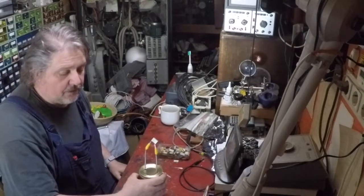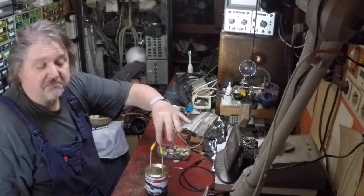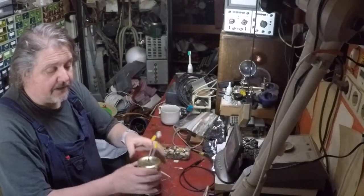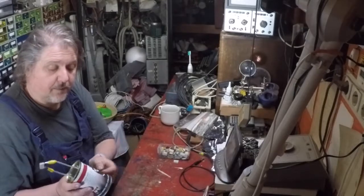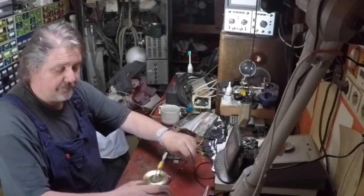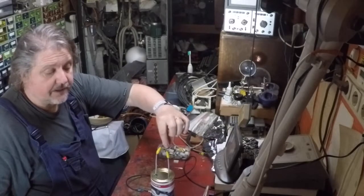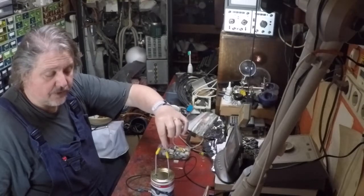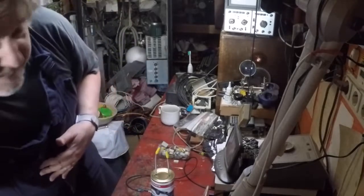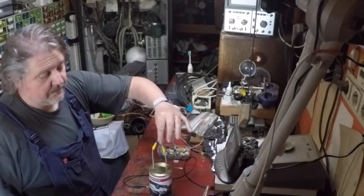What you see now hopefully is that both LEDs are off. Let's see if something happens when I touch it — no, nothing happens. So what I found out is if you don't have the connection to the oscilloscope ground, then the sensitivity just isn't good enough. So I added a 4mm jack here so I can connect to my earth. Now let's see if this is good enough — still not good enough, still not coupling enough through the outside foil. But I didn't turn on the AC, and still now we have more hum in the air — still not enough.